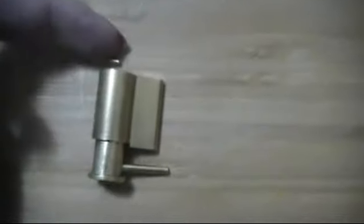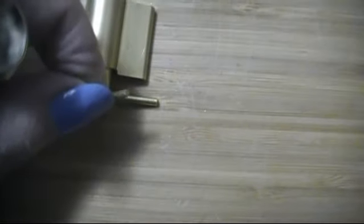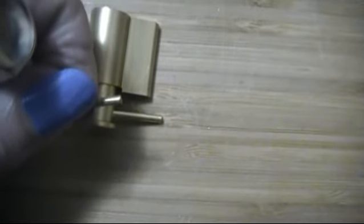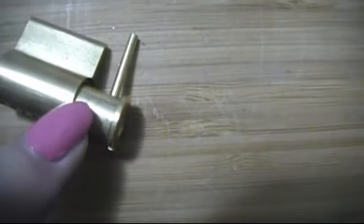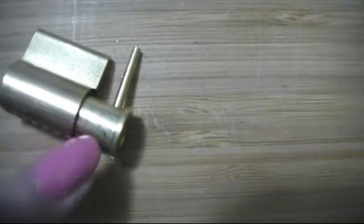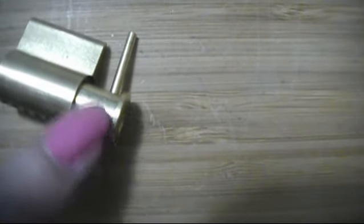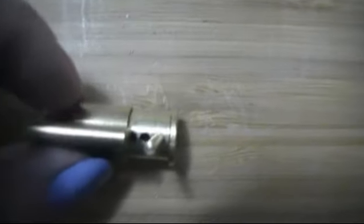That arbitrary number happens to be the same as this other piece. I'm not doing a good job of this. This other piece of stock I've got is a little narrower than that. This isn't necessary, I have it, so I'm going to use it. I'm going to drill a pinhole through the sheath, down into the core, sized for that, so that I can just drop it in there, and then I'll file it across so that it's all smooth, and it'll fit back in here. And this is important.